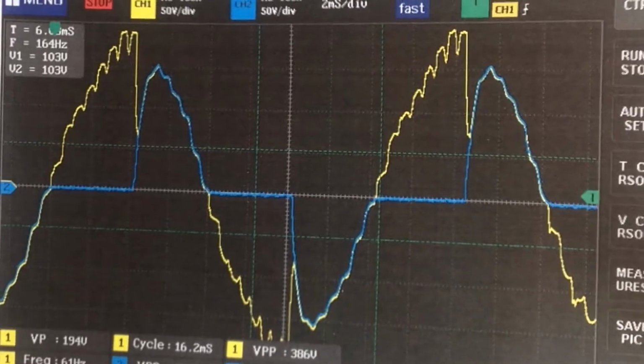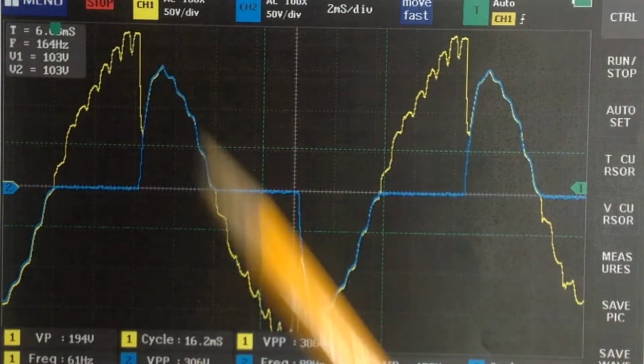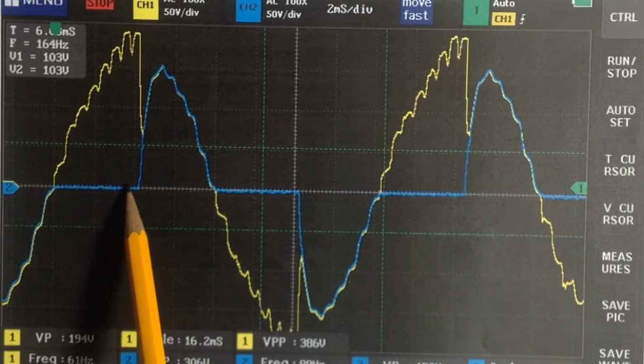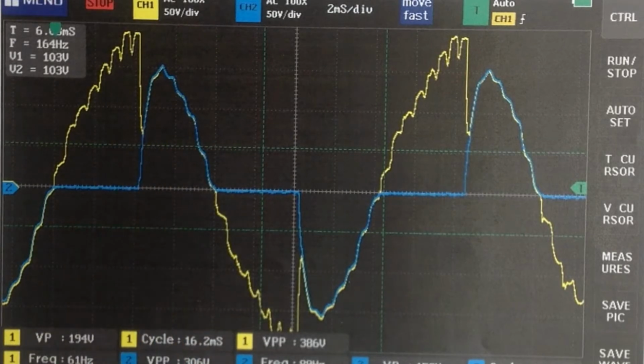So now the lamp has been switched on, and again we're switching a little past the peak of the waveform, and we see the blue line coming across here indicating the voltage to the lamp, and suddenly it switches on here, and when it does, there's a significant voltage drop in the driving waveform, entirely different than when it was being driven by the receptacle. So I thought, let's move on and let's try a much heavier generator.